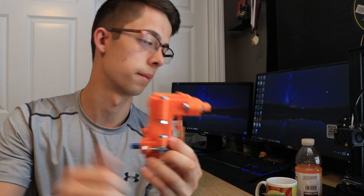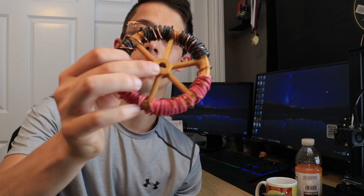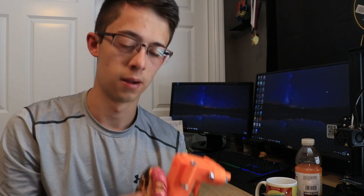The valve opens up, which lets air in through this nozzle, and it basically pushes the piston down. If you keep repeating that, it basically just creates circular motion. There's also a flywheel that I printed, but it wasn't heavy enough, so I just took some copper wire and wrapped it around it to give it some weight, and it does what I want it to.